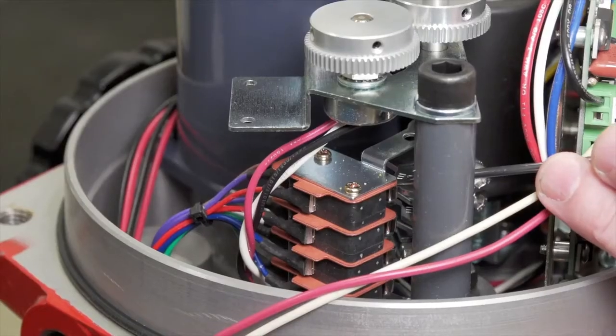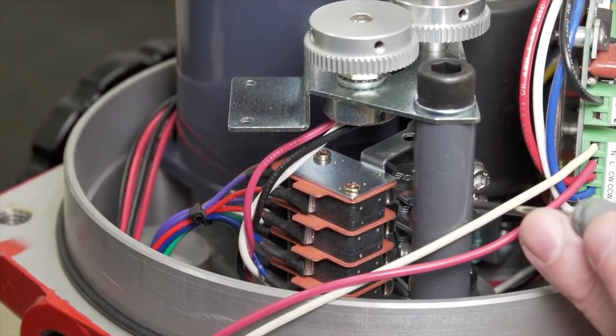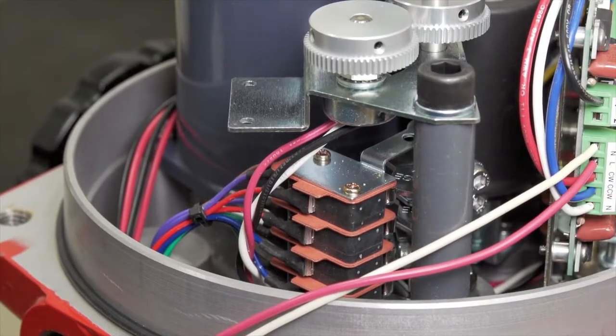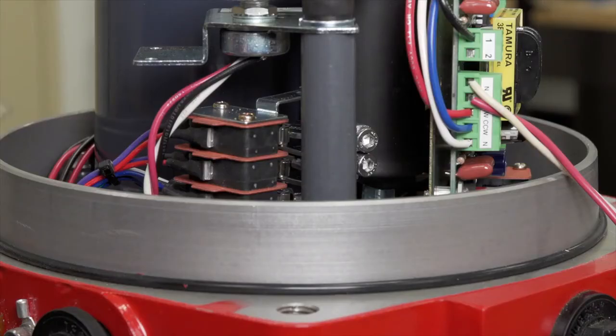Let's talk about troubleshooting. When trying to set the board, the cam will actually interfere with the limit switch, not allowing the board to go to full position. So when you're doing your adjustments, you want to make sure that your open and closed cams are not tripping. What needs to happen is we need to loosen the screw here and move the cam back to allow it to actually go to the position as needed.